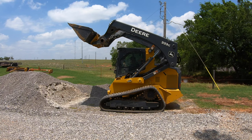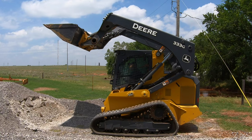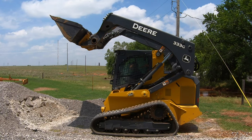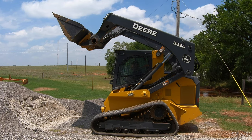You can override it forward as well. The thing we run into when we don't have this self-leveling feature is that sometimes operators raise the bucket up, don't think to level it out as they're going up, and then material starts to pour over the back of the bucket. I'll roll this bucket back and you can see just a little bit starting to shake out — and that's what we want to try to avoid, so we don't have material dumping out on top of us.